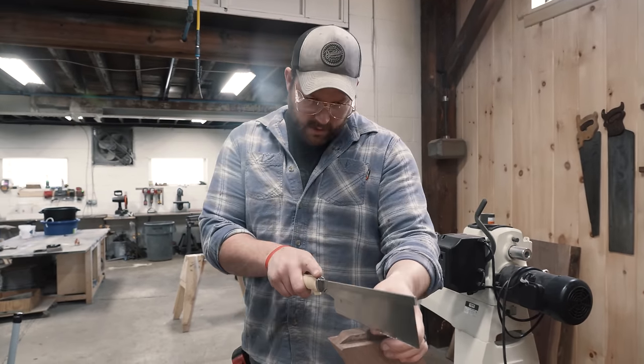All right, y'all. That was power carving, and that's a lot of fun. You should definitely try it if you haven't. Super versatile and actually not that intimidating. Really easy to control. So from here, obviously super rough, what I'm going to do is use some hand tools and get this down to the half inch depth that I drew along here, square up these edges, and hope that it looks good. That's pretty much what I do with most of my projects.